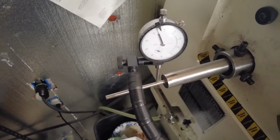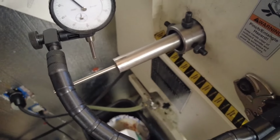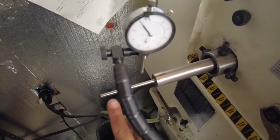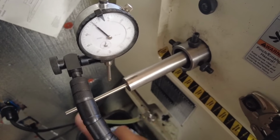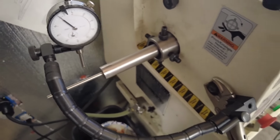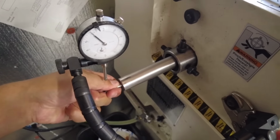I won't give you all my trade secrets, but that makes a huge difference in accuracy on your chamber job versus a prefit, where you can headspace your barrel with a barrel nut or screw down the barrel, but you don't know where your high side is unless you have a lathe or a way to indicate your bore. So that's what I do. Now let's set up the tenon job, let's get cutting, and I'll show you something else that I do.